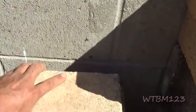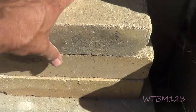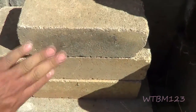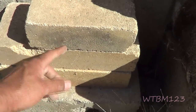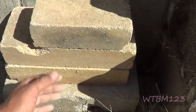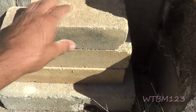With a normal joint blocker brick you'll strike it, but these don't. You butter the brick and you only have a 1/16 to an 1/8 inch gap, or mortar joint, in between them. So there's no striking. You just want to keep them clean, so that after you're done, any mortar that sticks on the outside — with the heat — will make it spall off and bring part of the brick with it. So what we would do is, after we got a wall done, if there's anything on it, we'd take burlap and some water, after the mortar was getting a little harder, and wash the wall down, just to keep that from spalling.